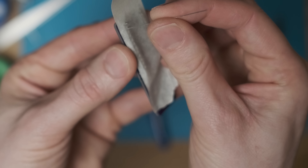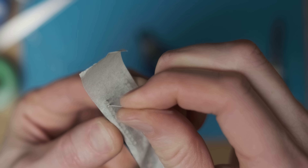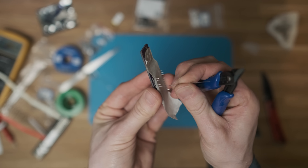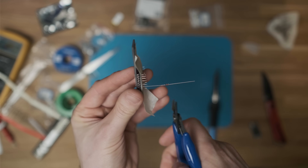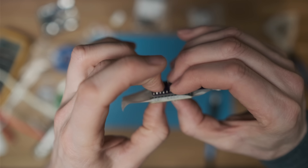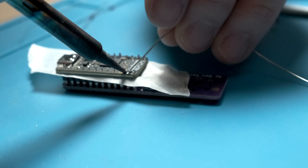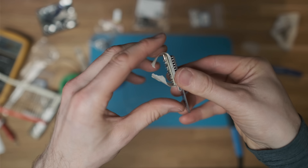I'm going to stick some masking tape over the top of those sockets, then use the legs of these diodes — I'll link to the exact diodes I'm using, as the wire thickness is just right. I push the leg through the tape into the socket hole and you'll feel it go in and stop at the bottom, then use these little snips to snip them off, making sure we allow enough length for the controller to sit over the top. We keep going until we've got a leg in each of the socket holes. Then we get the Nice Nano controller, place it over the top, make sure the pins are coming through each of the holes, and solder it onto those legs — heating up the through hole and the leg and dropping solder into the hole.